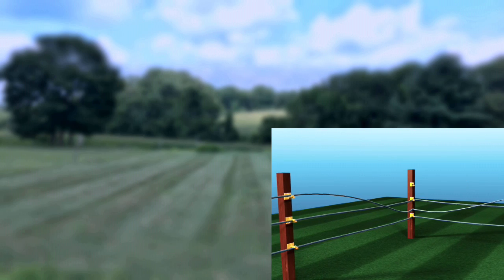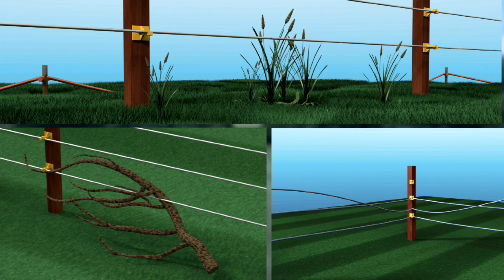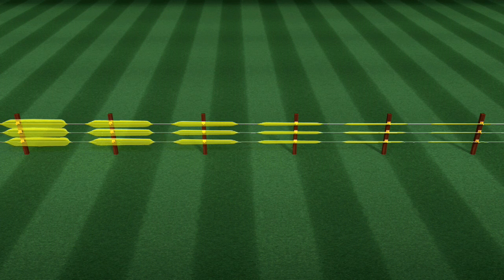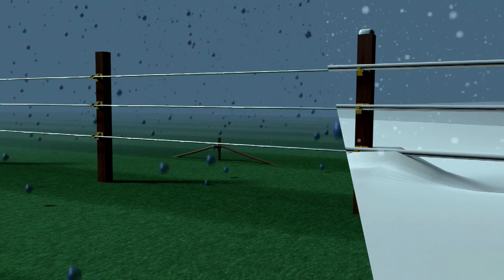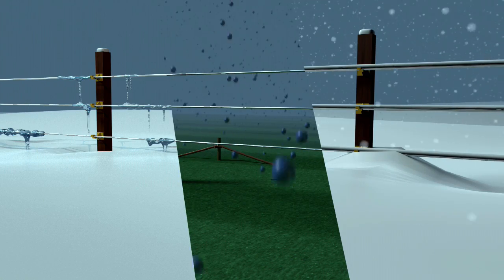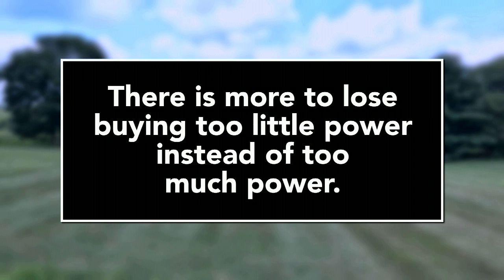There are many potential issues when it comes to fence grounding, and it's the most common problem with electric fence setups. Broken insulators can leak electric current to posts. Weeds and grass touching lines will drain voltage. Voltage running down a fence line will also naturally lose power the further away it is from your fence charger. Rain, snow, and cold — these weather events will also draw voltage down on your fence line.